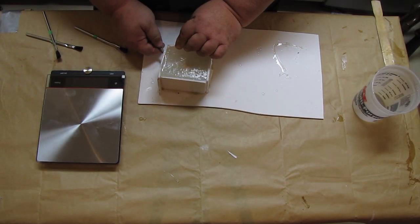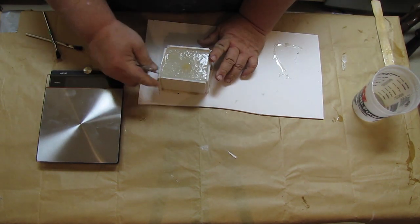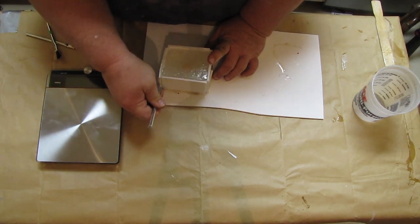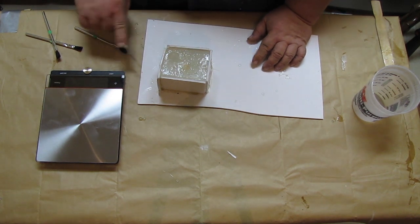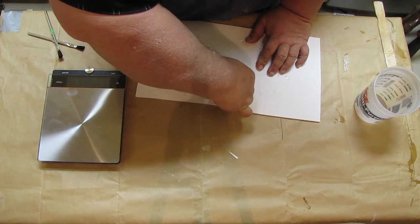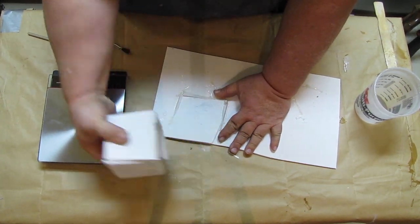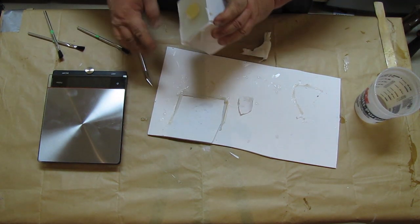Okay, so I'm just going to remove our little barrier here real fast, and I just cut this like this, just quickly. I'm not so worried about cutting the rubber now because the pattern is pretty far inside there. So it's just like this, and then I can cut right across the bottom, just above the glue line, and this way this thing will pop off quick. Push that forward a little bit to be more centralized here. Just going to tear it off. Alright. So, you see the bottom of our pattern there.